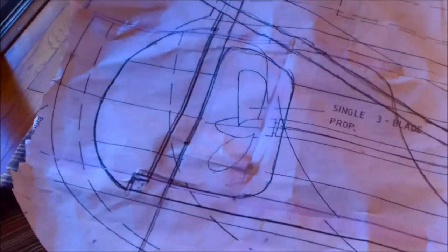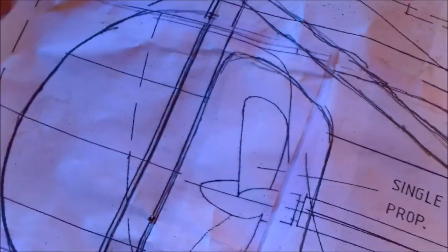This is the six-foot drawing showing the side view of the hull. For the rudder, I used one-eighth-inch aluminum — I'd put a piece of aluminum underneath with carbon paper, trace the outer shape, and cut it out. And this right here is the keel ribbing that runs all the way under the ship up to the front — I traced that all out with carbon paper underneath on a piece of quarter-inch plywood and copied that shape. I can get all of the detail off of here at double the original size.